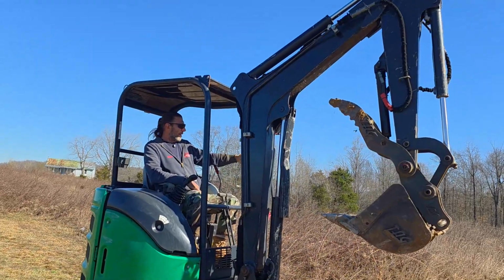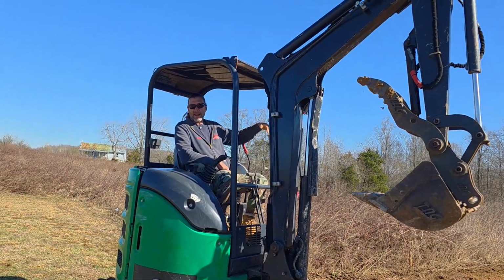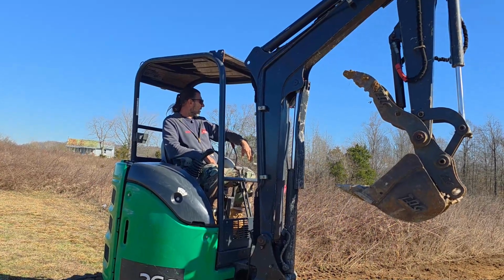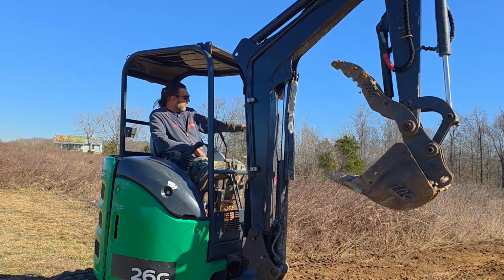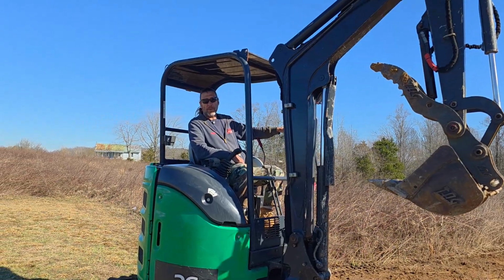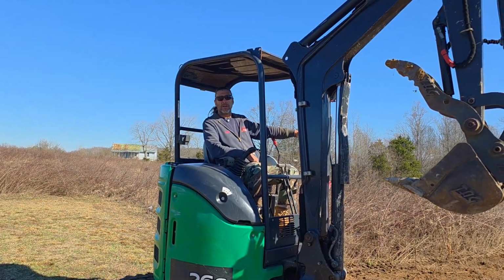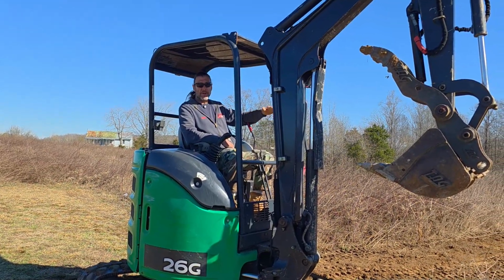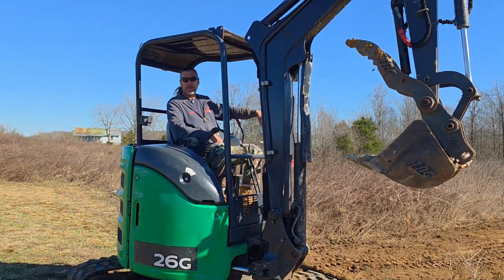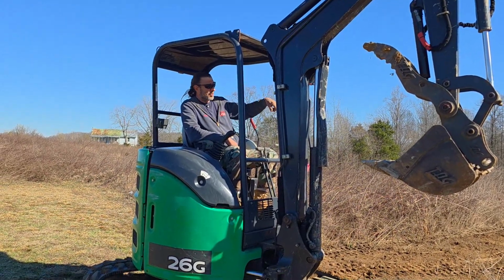It's the 30 feet from this 20 feet back that I really concentrated on getting all the organic matter out of, down till you can see how the soil changes color from that dark brown to that lighter color. That lighter color is good dirt, but there should be very little roots and organic matter in it. That's what we want to do, get all the organic matter off the top that would decompose once we pour concrete. And we're still going to dig in a little bit with our forms.